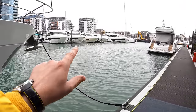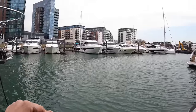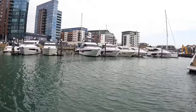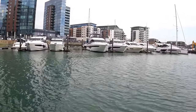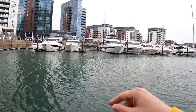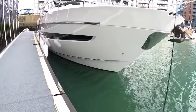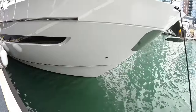If we look at these boats over here, you'll see exactly what I mean — right at the bow, you can see it on all of them. They're great; you need those on a planing boat. However, you do get slap against them from the waves. All the ripples slap against those chines, and when you're in the forward cabin, you can hear it. Well, not on here, because they're all under the waterline. There are no spray rails coming up.